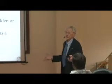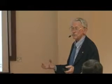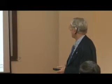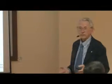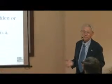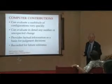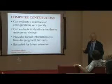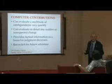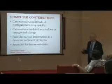Why are we even sitting here talking about a computerized program? Because you can check a multitude of possibilities very, very quickly and accurately. And if you do something that's a sudden change, a step change, or you're changing a bus, it will respond immediately. The information you get back will be fact, not expectation or estimates. And you will have a record, so if you come back or if somebody else comes back a year or two in the future, they can say, well, this is what they did when they had the event 2 years ago, and as we recall, there were some problems here that were unexpected. We should look at that, and the rest of it went pretty well.